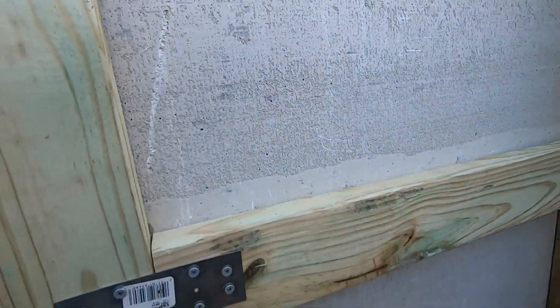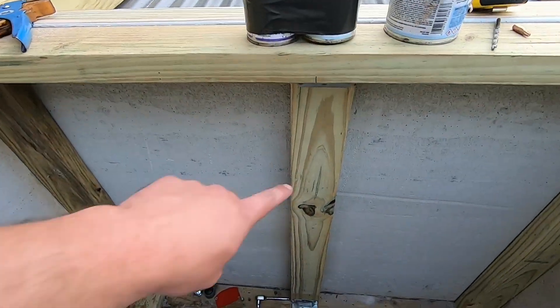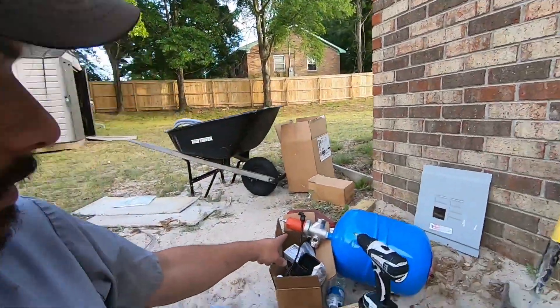I got to rip the back of this pump off and wire it differently — not changing the voltage, just making it so I can have a remote pressure switch. I got a little board installed. That's gonna have two purposes: number one, to mount the tank right here; and number two, the sides here kind of had a little bulge — a little beer belly. I already came back and put braces on all four corners to try to minimize that. Now I'm going to mount the tank and the valve right there to that board.